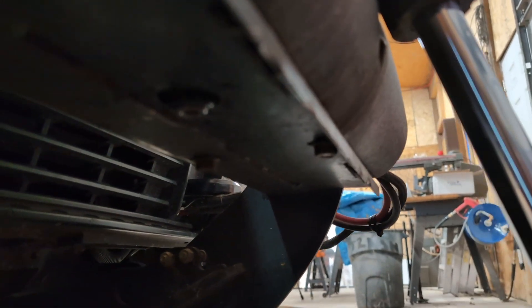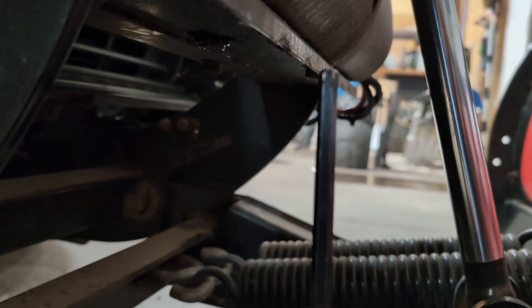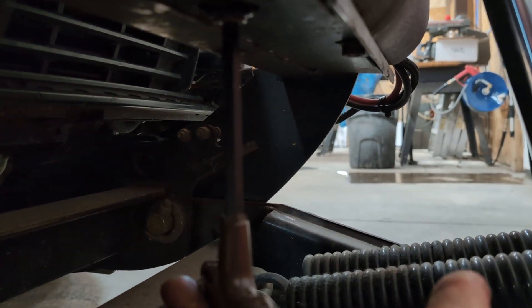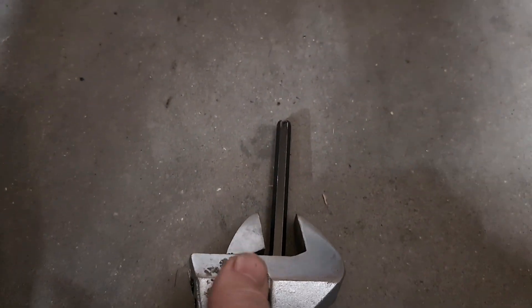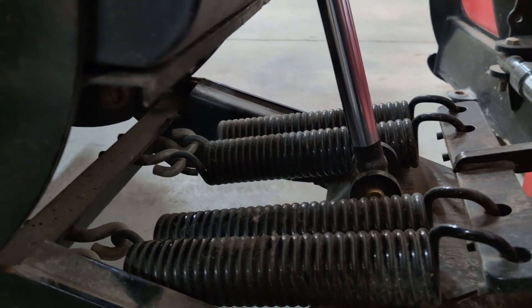Up underneath the headgear, there's going to be an Allen drain plug. I use this 8mm Allen T — it goes right on there. It's probably going to be tight, so what I do is take the crescent wrench and put it onto the Allen wrench to get a little bit more torque. You just want to be careful so you don't strip out the Allen head or snap off the wrench into the Allen plug. That would not be good.